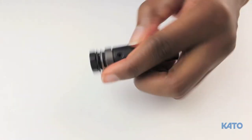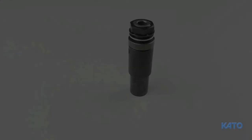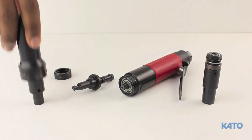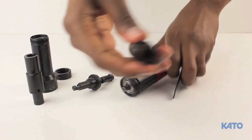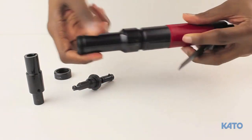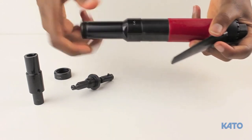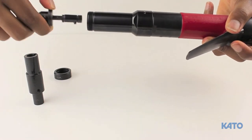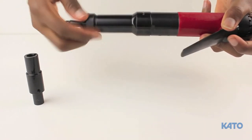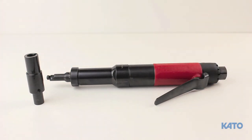We're going to add one flat to our tool. The clutch drive is now set up and ready for use. The clutch drive actually replaces the drive sleeve inside the adapter — remove the drive sleeve from the adapter. Slide the clutch onto the air motor, then slide the adapter housing over the clutch drive and turn counterclockwise to tighten. Next, slide the front end assembly into the adapter and tighten. As noted in the air tool video, all the threads are left-hand threads. A good hand tightening is all that's needed — do not over tighten the adapter or front end assembly.